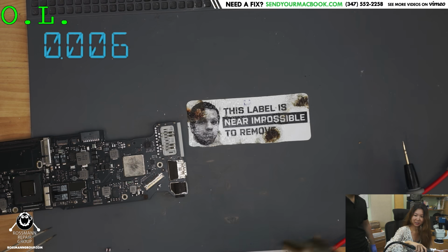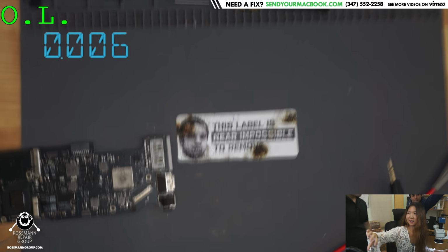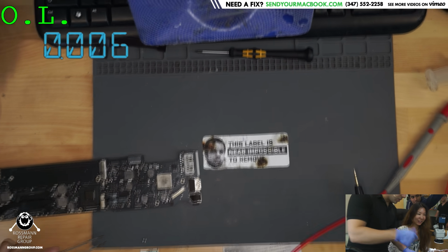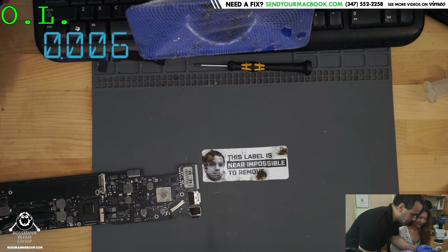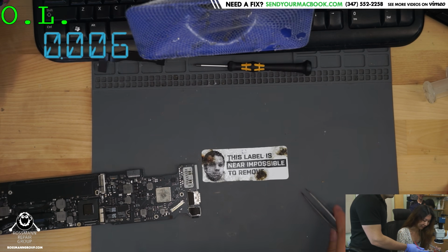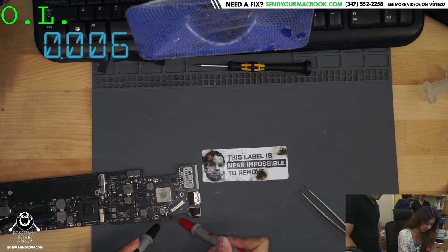Okay, put this back in there. Do I turn it off? No, like this. See? Like that. There you go. Oh, it's still on. Now we're going to see if it stays on to cool itself off. So now we're going to see if we still have a short circuit. So I want you to put one probe on the left pad and this on the right pad that you just took that component off of. Don't turn on the fume track. This and this? Yep, and your short circuit's gone. So you fixed it.